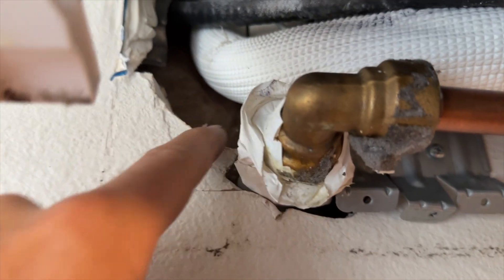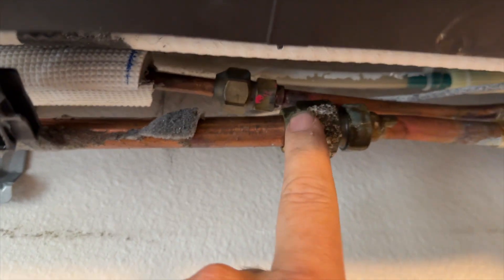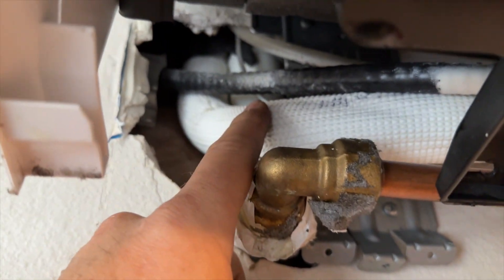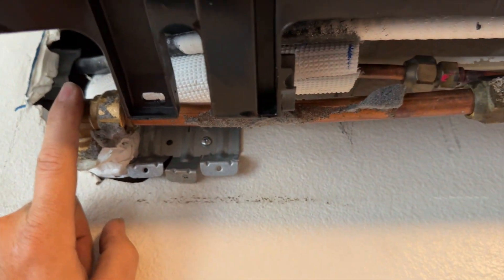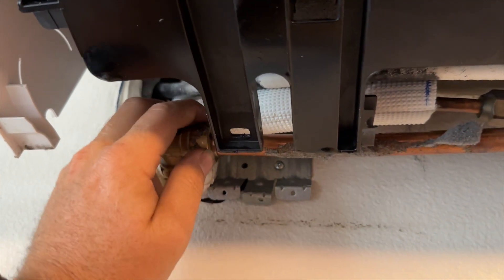Usually the pipe is in the walls. I have to cut this open to get in there, then cut this out, and I braze in a whole new piece and reflare. Usually there's one on the five-eighths line and the three-eighths — in this case it's only on the five-eighths, which is a little less work. This whole building is like this; this is probably number 14 I've done.